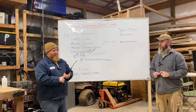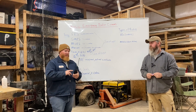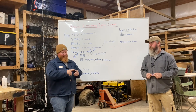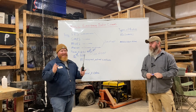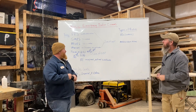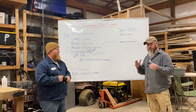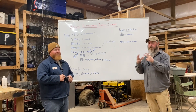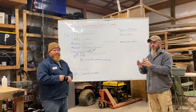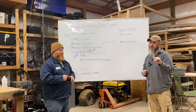With HF you can throw wire out in a field, string something up five to six feet off the ground, and have regional comms. Portable HF operators can usually have a setup running within minutes. You just need a power source — solar is the best way to go — or a battery. Throw a line over a tree, make sure your wire lengths are right, and that's really all that matters.